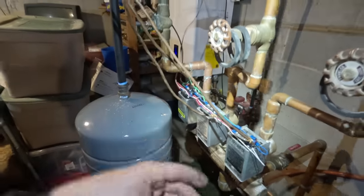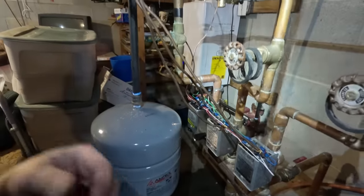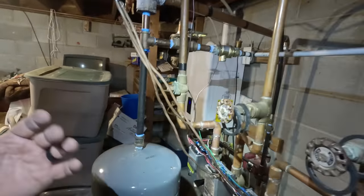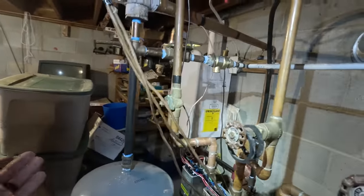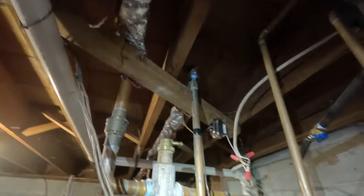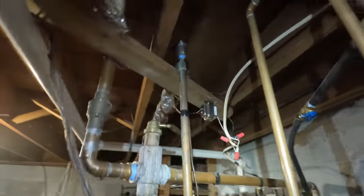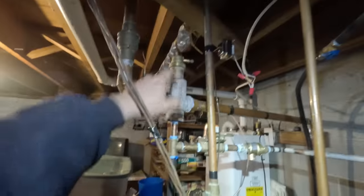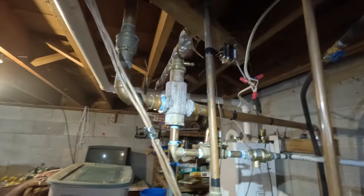That's good — it means we're coming back warm on those two at least. One of them must be the slab loop since they're worried it might be leaking. The main problem we had was the wiring was not making good contact with the zone valves — they weren't sending a call to the boiler every time. Some zones were opening, there was air in the system, no way to really bleed it, and the auto bleeder was gummed up. That pretty much wraps it up, other than coming back to replace that spiral vent. If you enjoyed the video, give it a thumbs up and leave a comment — catch you on the next one.